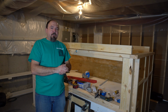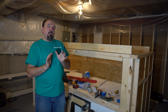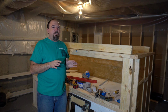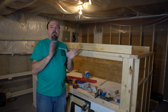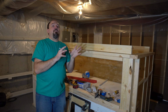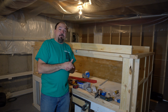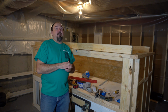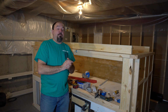And I've got to get a humidity control system in place for this fish room, which this time around I'm going to be going with a ducted whole house dehumidifier. At least that's the initial plan. It should have enough capacity to deal with all the humidity in here. And because it's going to be ducted, I'm going to target the humidity and the moisture in the air right from its source. Now the dehumidifier is also going to be controlling humidity for the main display tanks by using its ducted fan to pull air through the display.